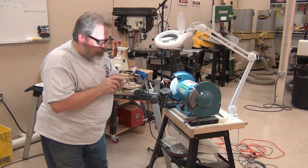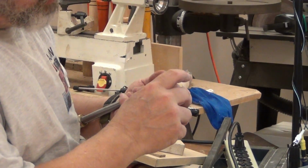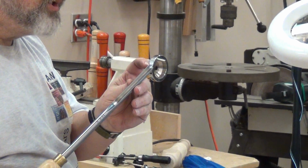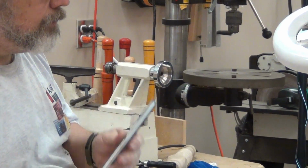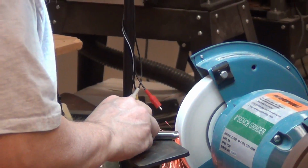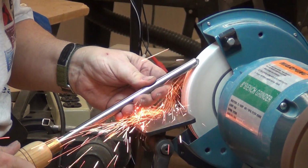And what do you do there? Well, really all you're gonna do is take off this. Your nose is probably okay. That angle here is probably okay. Let's see where we're at. We're at 60. Pretty close, about maybe 55 or so, but that's okay. So what you really want to do now is give yourself that slight convex profile. And Doug tends to do it like this. And I've tended to do it like this.